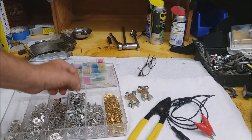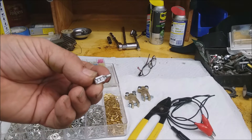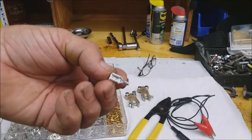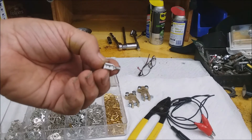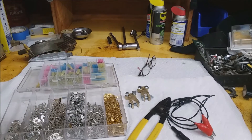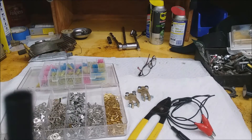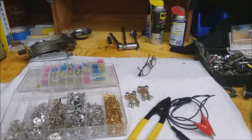There's nothing better than a solder connection. I was an AT&T engineer for many years and also an instructor, and I can tell you the best electrical connection is a solder type connection. I take a solder connector, make my connection, then slide heat shrink tubing over it so there's no exposed metal. That way you have a waterproof connection with the heat shrink around it, making a very, very good electrical connection.